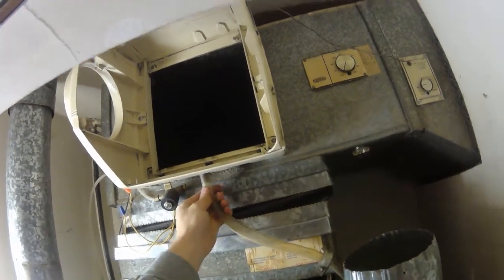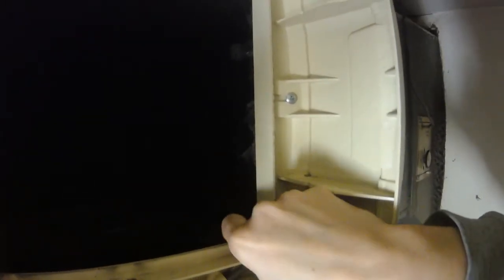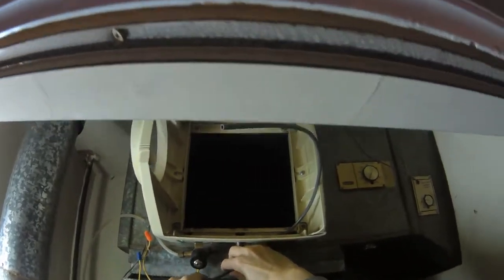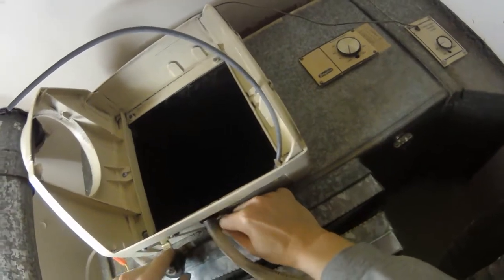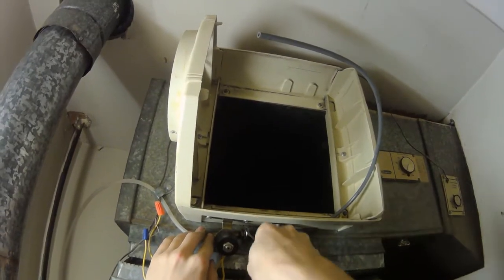You can put this guy back in there. So we've got our new parts here. Before we attach the new water line, we need to snake it through the case. After we snake the water line through the case, we can now put on our ferrule and compression nut. I can now secure the nut to the solenoid water valve.